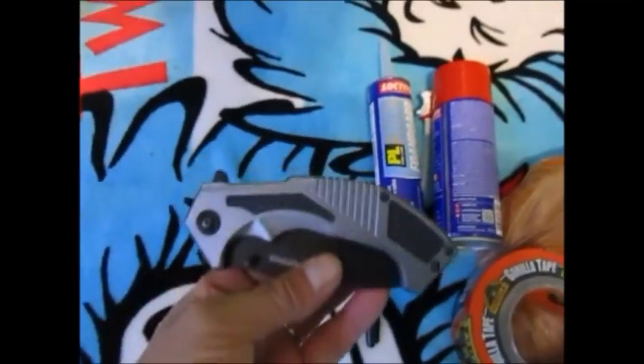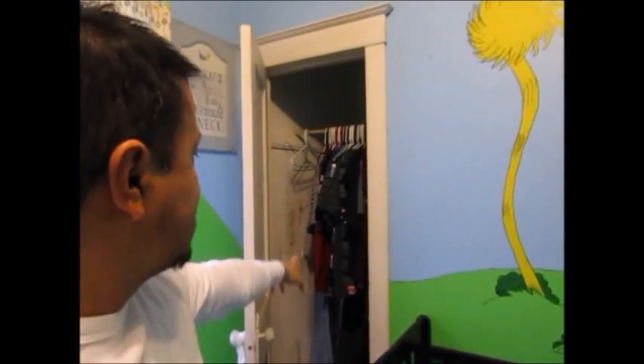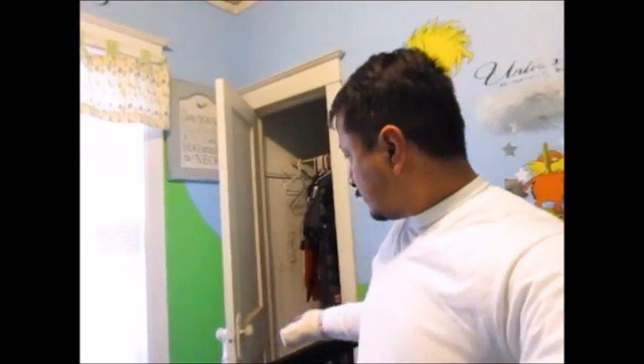I've got my trusty Marine Corps knife my son got me — this thing is sharper than sharp. I bought some tape to tape it together and a measuring board. What I'm going to do is put styrofoam board over this area. These are nine-and-a-half-foot ceilings and I drove home in my Astro van — it was six degrees yesterday — with four-by-eight sheets. I'm going to do solid sheets up to the top and then add a foot of it at the bottom.